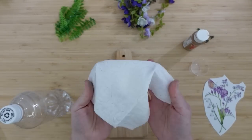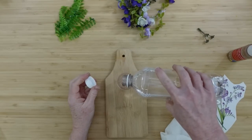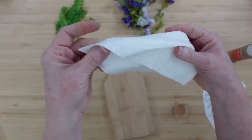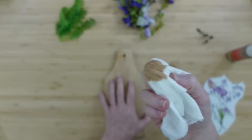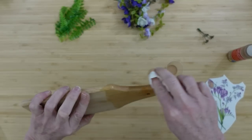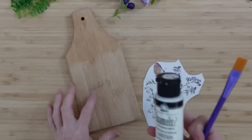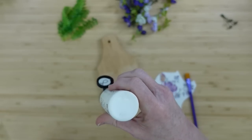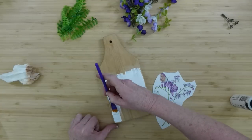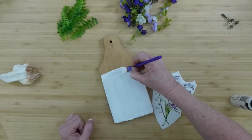It's nice and dry now — we've allowed it to dry. I'm going to take a little bit of golden brown paint with a little bit of water and make sort of a very light stain. I just want to give a little life back to the wood since I've sanded it — it's just bamboo, but I wanted to make it look a little more expensive. I used this type of a shape based on the size of the rub-on transfer I was going to do, because I want the top to be like a very pale stain look, and the bottom is going to be white — we're going to put the rub-on transfer on top of paint. I did three coats and let it dry, getting around the edges of that as well so it would have a nice continuous look.